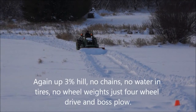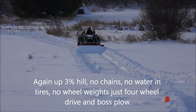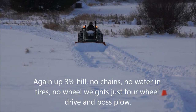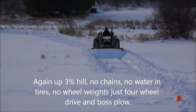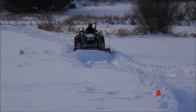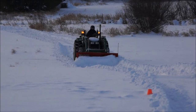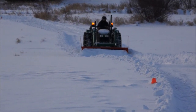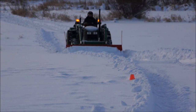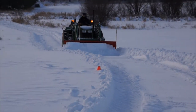It has the float system hydraulically, so basically it can take the contours of the driveway as it rocks and rolls up and down. The last part of the driveway goes up to about a three percent hill climb and it was just no big deal — it went right up. Can't speak highly enough of the Boss plow system. I really like how it operates and the fact that it's got a universal skid steer attachment that just instantly attaches to the front end of a loader like the 553 on this 5055E John Deere.